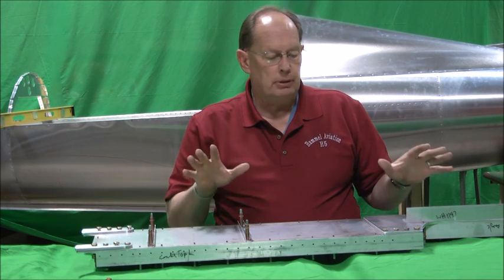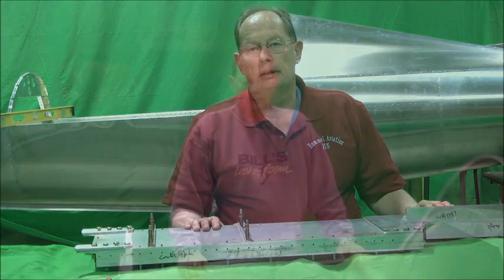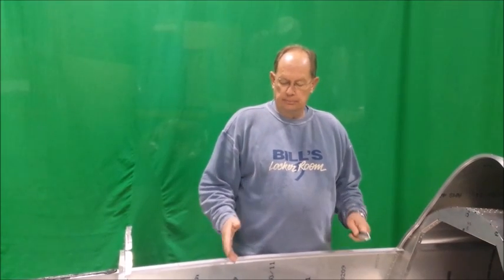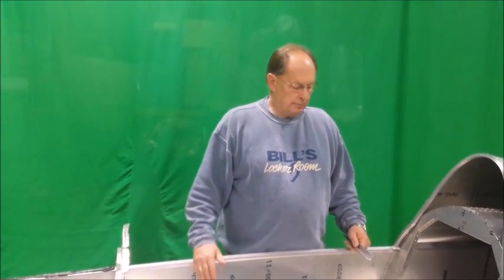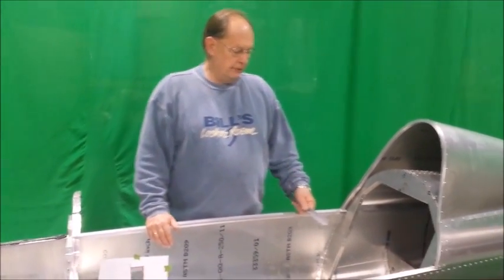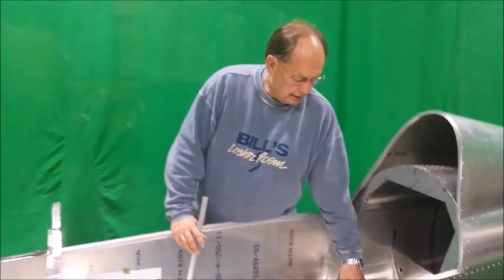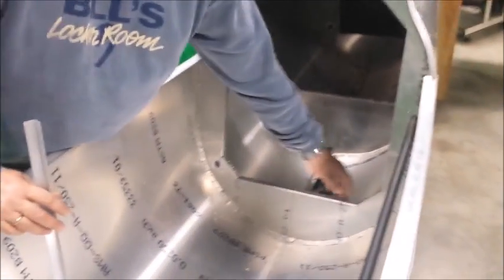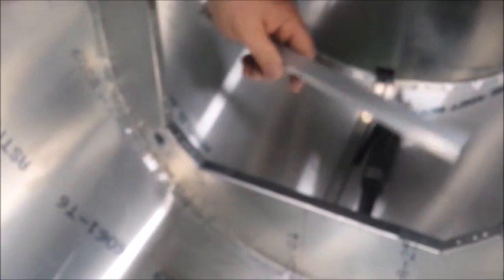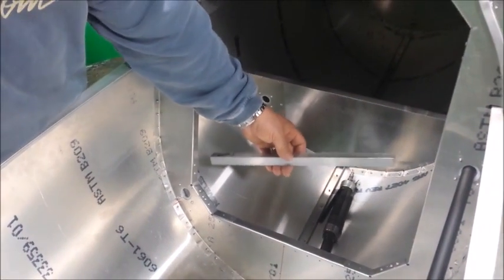So at this point we're going to rivet this spar assembly. The next step we want to cover is marking the fuselage, getting in preparation to put the spars through, the main wing spar and then the trailing edge spar. And we'll start with the trailing edge spar back here, and hopefully you saw the note on the plans if you're scratch building or from a kit that you have not installed these lower rivets here in the corner supports for the bulkhead. What we want to do is mark a spot on the fuselage for the rear spar, which is 3/4 angle to come through there.